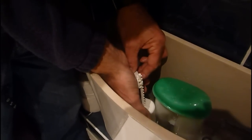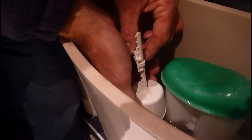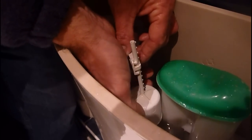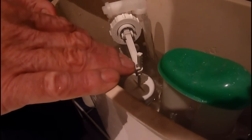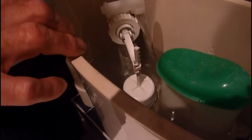Look, you've got this type of arrangement here. This little valve twists around — just watch. I'm twisting that round — can you see it? As you twist it round you get to there, and then you can move it up and down. So we'll take a guess for now and take it about halfway down. Twist it back in again, like so, and it's locked again. Now we're going to let it fill and bring it up to the correct level. It's very easy to adjust — no tools required at all. You just literally turn it by hand, unlock it, and let it drop up and down.